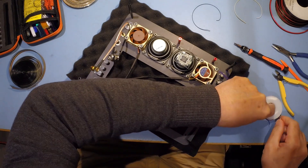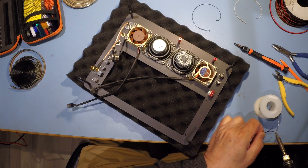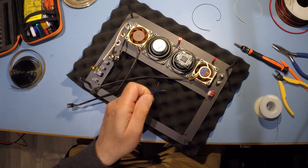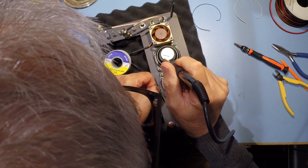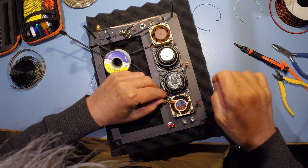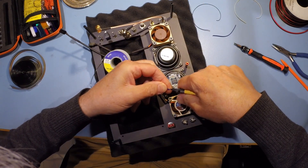Always tin the ends of the cable that you're going to solder. I need to get some more solder as I'm running out. Make sure you clean the solder tip — wipe it on the solder pad — then tin the ends of the cables. Blow the flux fumes away. We'll use purple for the positive cable. Keep it as still as you can, then measure the length to the speaker — keep it as neat as we can. Cut it off.